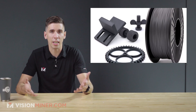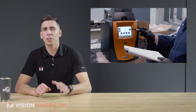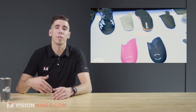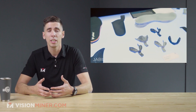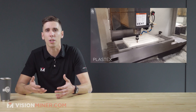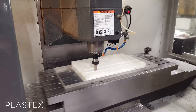PA — that's nylon, we all knew that — and then 0600, let's look a little more into this. Jabil claims that the new material delivers high strength and stiffness required for aerospace, automotive, and manufacturing applications, and they designed it as a replacement for Delrin, or POM, or acetal, which is a super widely used material in all these industries, especially in manufacturing.